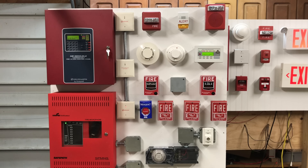And that is the entire system. I cannot wait to start making videos on this system, as voice evacuation systems are becoming a technology used more and more today. What makes these different from regular horn strobe systems is that the fire alarm gives actual live or pre-recorded voice commands about the type of emergency and how to react, rather than just sounding an alarm until silenced. Most buildings more than seven stories tall, or large buildings in general, are now required to have voice evacuation systems. Thank you for watching — please rate, comment, and subscribe, and have a great day.